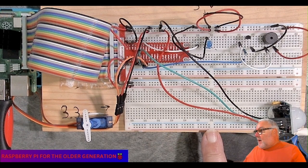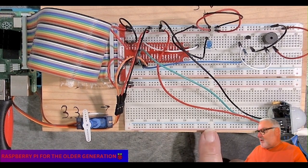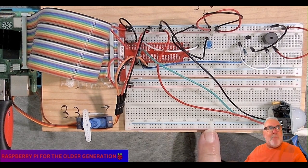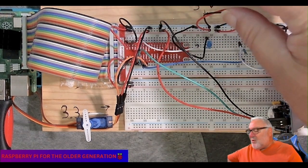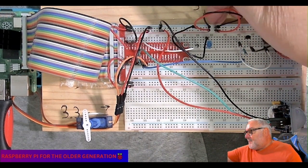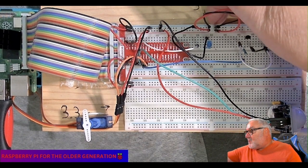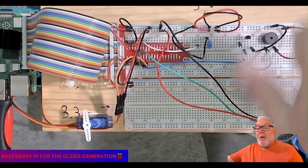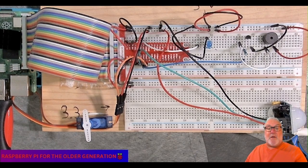there's a gap. And when I tested my circuits with one of them little meter things, voltmeter, are they called? I found that the buzzer wasn't live. Okay, because on my breadboard, they're not joined across here. So what I had to do, if you look here, I put two jumper wires and connected the two together, the live, the 5 volts and the ground. And now when I tested my circuit, my buzzer is now live. Okay, so that's what I had to do. You may not have to do this. All right, you may not have to do this. Right.